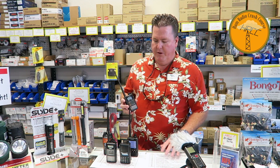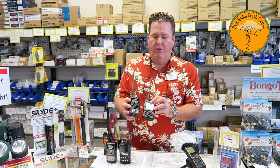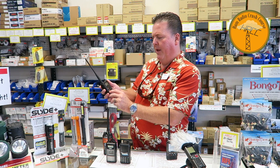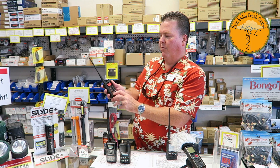With DMR digital radios you need a code plug that you download from the internet — it's not something that's user-programmable from the face of the radio. DMR is a little different. Whereas with fusion digital, or D-Star, you can enter frequencies right from the front panel. The nice thing is, if I want to enter a frequency I can press Function then number four to adjust the step size.